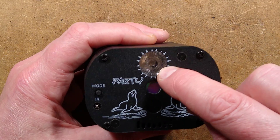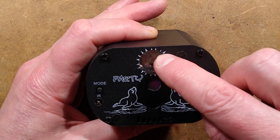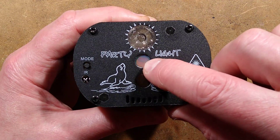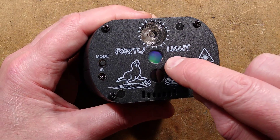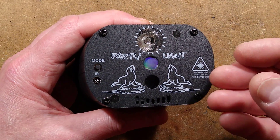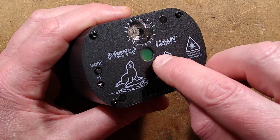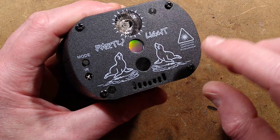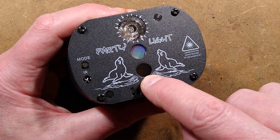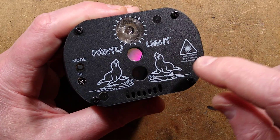Here is the LED, and unusually they've designed it to actually create a mottled pattern from the light — it's got red, green, blue chips behind it. There is the green laser in a much larger barrel, and the green laser has an extra diffraction grating at the front because the green is much brighter and also because it's closer to the peak spectral sensitivity of the eye, it has that brighter effect. They've split it into multiple patterns, so effectively what you're seeing is the same effect that would come out the red port, multiplied a huge number of times by this extra diffraction grating in the front.